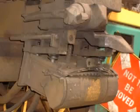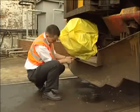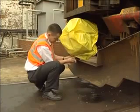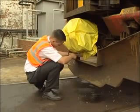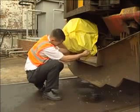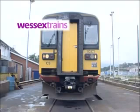If the electrical connection block itself is damaged, misaligned or partially retracted, it'll be impossible to achieve a proper attachment of two units. Finally, in snow or severe weather conditions, Wessex Control will issue an adverse weather warning. Drivers at remote locations must make sure that exposed couplers are protected by the weatherproof bags provided. This program is intended to highlight the various coupling and uncoupling procedures for Wessex trains. For more detailed information you should consult the written publications or seek the advice of your driver manager.